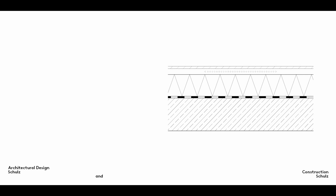Roof sheathing in the form of timber planking or wood composite decking boards is then fitted over the insulation, leaving a gap. This gap ventilates the roof structure above the insulation, allowing any moisture from the interior of the building to evaporate. This distance between the insulation and sheathing is created by making the joists higher than the insulation or installing battens on top of the joists.